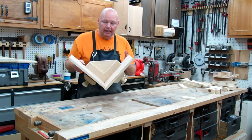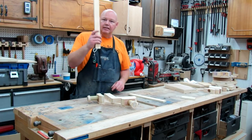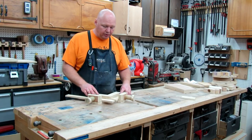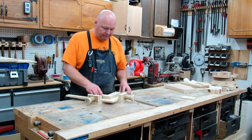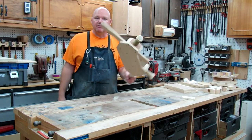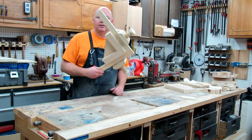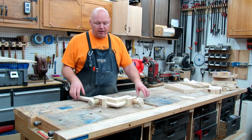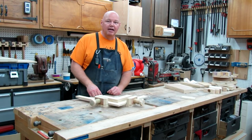I think these clamps are going to come in really handy — I'm going to batch out a few more. I'm going to back these out pretty much to the maximum. This is an inch-and-three-quarter wide by half-inch thick material. Let's say you were going to make a face frame out of this — clamp that up, that holds, clamp this up, that holds. There's your face frames clamped and ready to be attached. This thing holds really tight — I'm very impressed. It'll hold down to a minimum of half-inch material, which I think is pretty good. You can always change your clamp to accommodate wider material. That's the great thing about shop-made clamps — you can customize them to your needs.